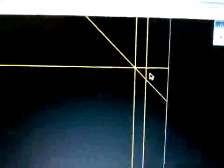So what I gotta do next is connect all these lines to connect my chamfer there. So first of all, I gotta delete this point, delete, and then I gotta hit this line and this line. To do so, you click this line first, and then you hold CTRL and hit the next line, so they can both be highlighted. And then you hit connect. Bam. Okay, and then you hit this line, CTRL, and that line, like that. I hit this line and this line, which are highlighted, and then you come over here and connect. There you go. You now have a chamfer.